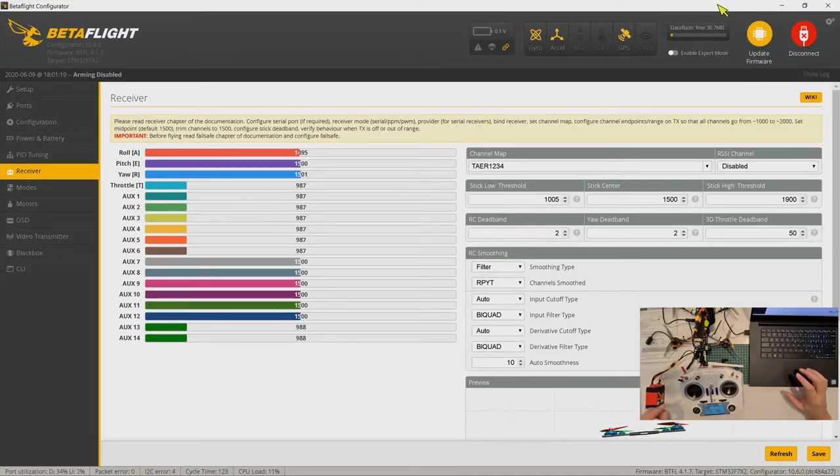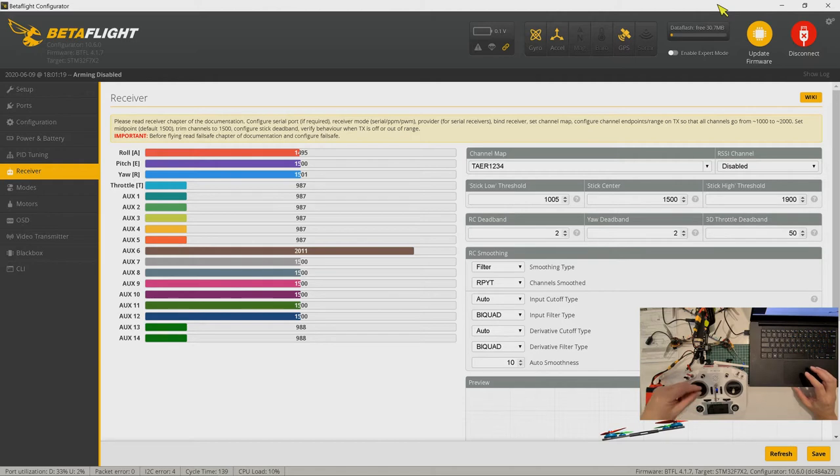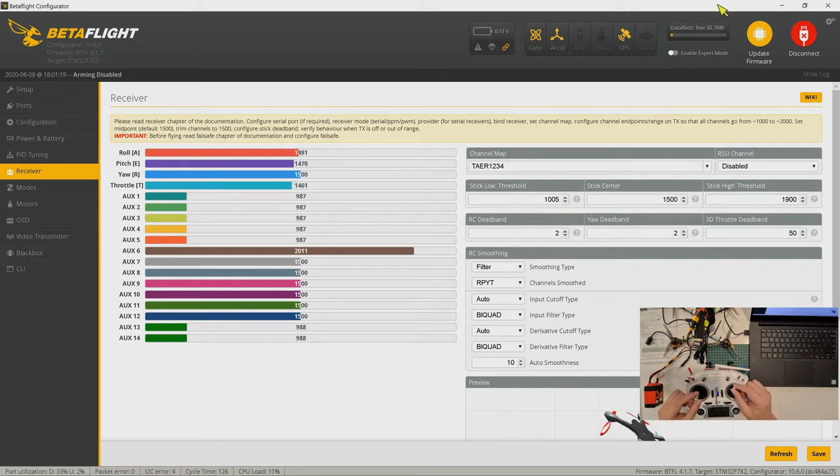Okay, so now we are at Mark 4. Okay, so now I'll switch off everything. Okay. Telemetry lost. See? The throttle is now working. Actually, in fact, telemetry recovered. For this quad. Telemetry lost. For this flight controller, there is no need to actually connect the battery to check your sticks. It's able to power on the receiver even without the battery connected. So you can see now I push up and down, left, right, and the sticks are all working.